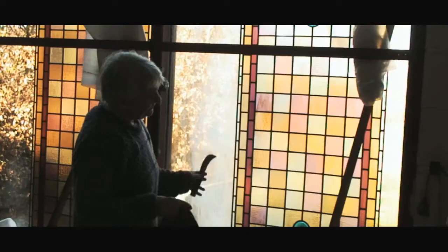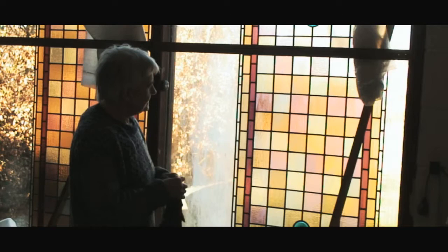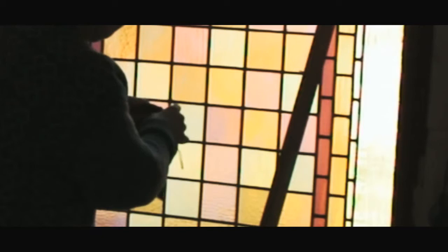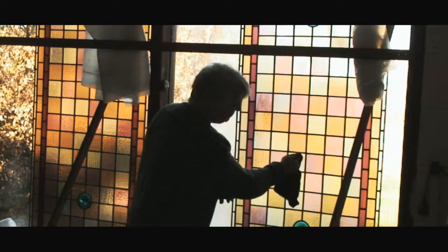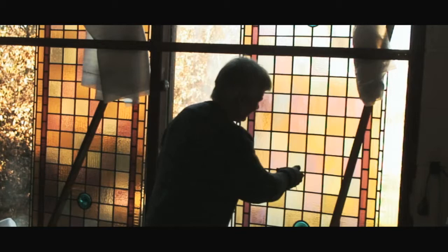You can see how it's beautiful — it's clean, it's looking pretty solid. Any broken pieces have now been replaced and what I've got to do now is just finish cleaning away any residue of that black putty. I'm going round each pane with a knife, just cutting it back and making sure each little pane is clean. It's rather a laborious job and certainly not a particularly skilled or enjoyable job, but unfortunately it has to be done, so we just have to put up with it.